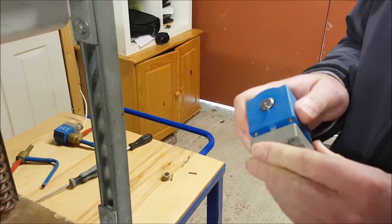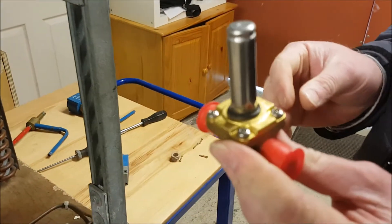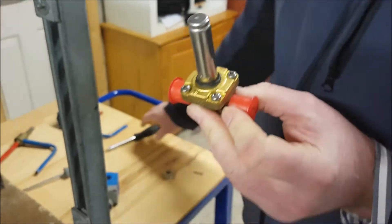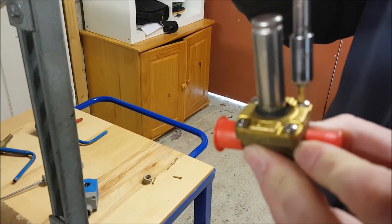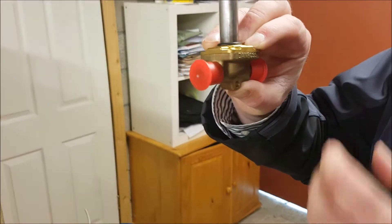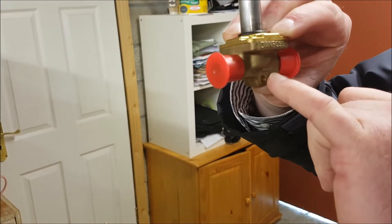The body itself has four screws, and this particular one has a start screw. I'm going to take off these screws. I've just removed the screws, and before I take the valve body assembly apart, I just want to bring your attention to this arrow.